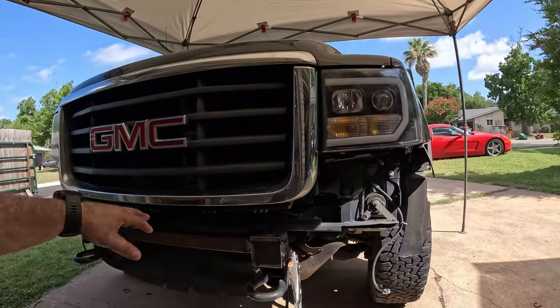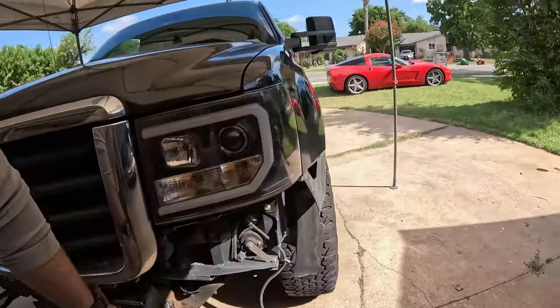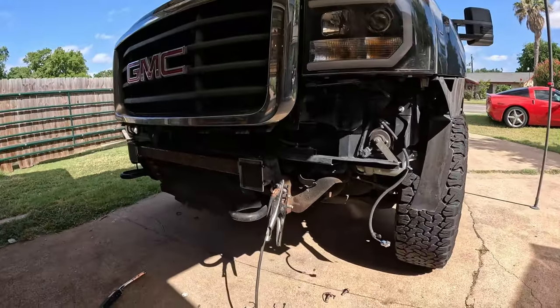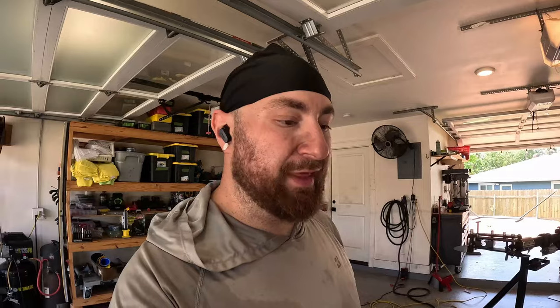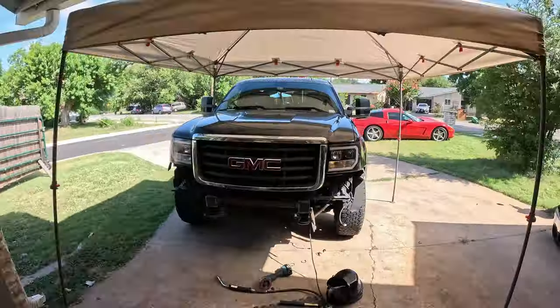The next question is where to put the primary bar. We have to cover this lower area and also come up and cover the upper area. I'm still figuring it out. The design I decide to go with is basically a front mustache bar, then we'll build the sides off of that. It's kind of a cop-out because I'm not confident in my multi-plane bending skills — this way we can bend curves individually in pieces and weld them all together.